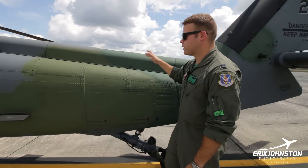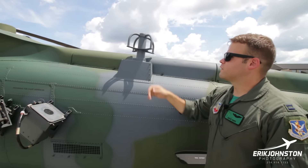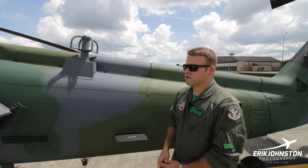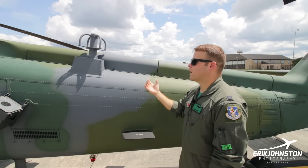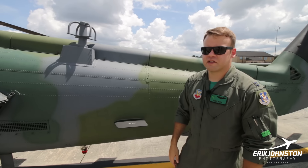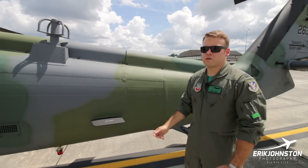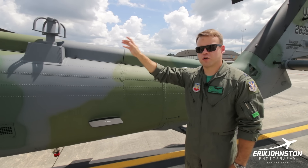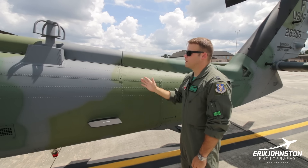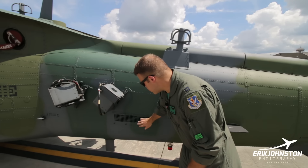On the left side we've got some more holes for the blade fold brackets. We've got the other VOR antenna here, and this is one of our SATCOM and line-of-sight radio antennas — we call these egg beaters. There's one here and another further up near the APU, and these allow us to speak to various agencies on VHF or UHF radios, as well as UHF SATCOM for long-range connectivity. One thing you'll notice different from an Army UH-60 is the original Pavehawks had a large HF antenna rail running down the side. HF bounces radio waves off the atmosphere for super long range — it's low tech but works really well. The Army still uses it, but the Air Force has since moved away from it.